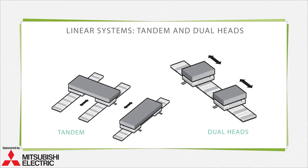Linear servo systems can install in pairs to form tandem configurations, which is particularly useful for large machine axes needing accurate synchronous strokes. Another installation variation is a multi-head setup to allow independent control of twinned motor coils to simplify axes. Such setups excel on axes that must have quick response.